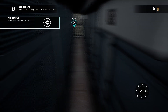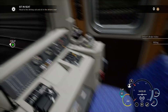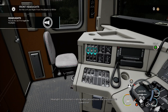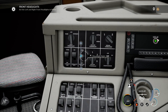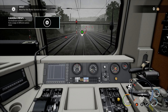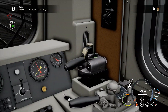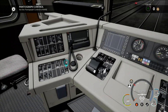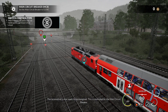A lot of your time will be spent in the driver's seat. To get the locomotive up and running, set the master switch. Headlights are important in letting others around know that a locomotive is operational. We now need to wait a moment and let the brake system charge — it'll take a minute or two. The locomotive is now ready to be energised, controlled by the main circuit breaker.